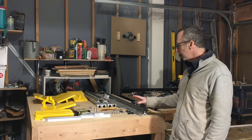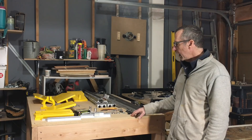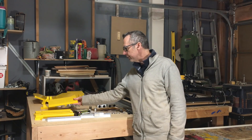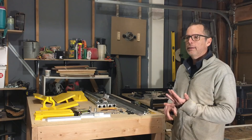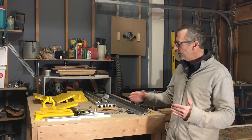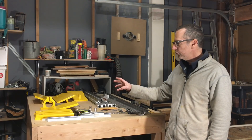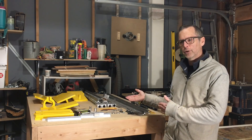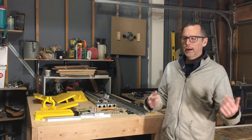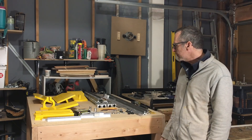So far at this point, not a whole lot has changed since my last episode. I have managed to cut out all the end plates for the X, Y, and Z axis, under mount, gantry sides. Those were cut from 18 millimeter thick, 13-ply Baltic birch plywood. What I decided to do after I cut them out was to give them a coat of some oil-based paint in order to seal the wood and protect it from any airborne moisture. Although that's usually not a major issue with Baltic birch — that's more of an issue with MDF. But I wanted to go ahead and get a coat of paint anyways, and I think it looks kind of cool.